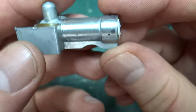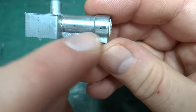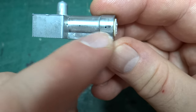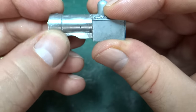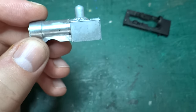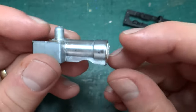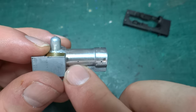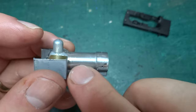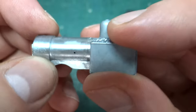I've also gone and removed most of the remaining pipe work. There was lots of pipe work moulded into the body - a pipe that ran all the way along into the smoke box, which was for the blower. There was actually one on this side as well. But looking at photos in the book we were using - Tom Rolt's Railway Adventure book - at the time I'm trying to model, there was only a blower on one side. So I've drilled a hole where I can put the wire in but taken off the moulded pipe on this side, and taken off the pipe work entirely on the other side.